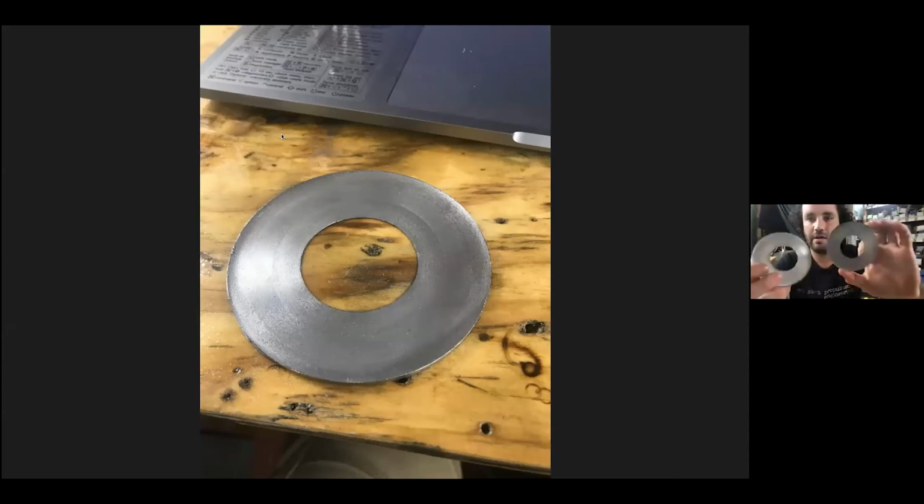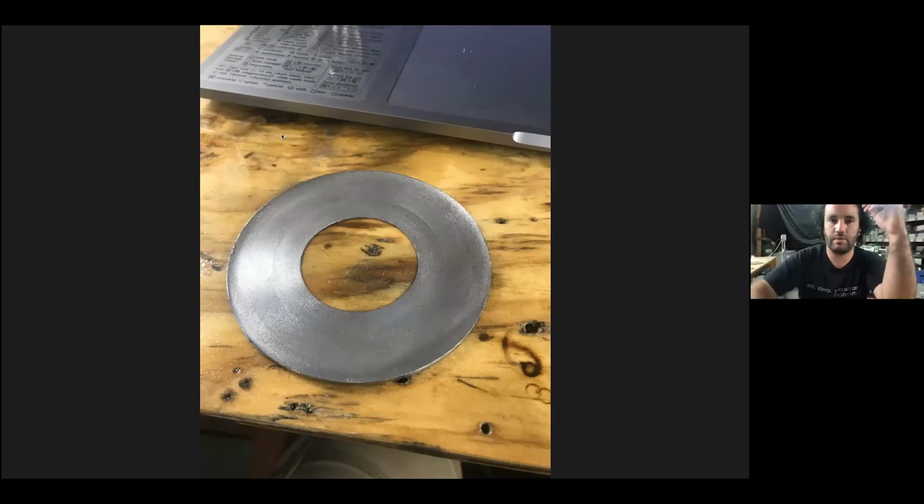They are right here. These are going to be magnetic lenses to correct for the anomalies, the issues that we were seeing with the magnetic field's homogeneity. The good thing about it is I could change these out as little inserts against the magnetic field plates, and then we can see how that correlates with the magnetic field readings that we're getting.